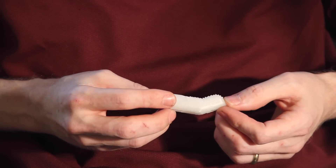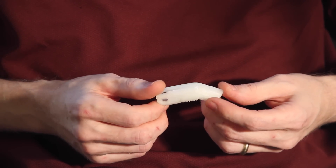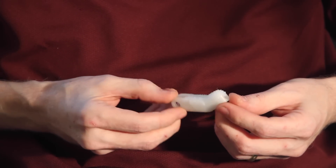The material itself is really nice. A lot of people I've seen asking, what's the big deal about nylon? Why should we be looking at this? The easiest way to show that is a comparison here. I have the same part printed in ABS plastic, which is what's commonly used for these prosthetics — PLA would be about the same. As you can see, there are some thinner parts on this model that would be points of stress that can get broken if things are pulled or bent the wrong way. Most of you have experience with ABS — you know that if you put too much pressure on it, it's going to break right off. And that's why you have to worry about stress points and how strong the part is going to be at those points.